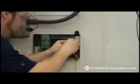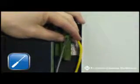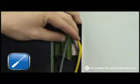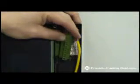Twist the shielded and black wires together. With the probe terminal block removed from the board, insert the red in the top slot and the black shielded pair into the next terminal and tighten. Pull on the wires to make certain they are seated and repeat the process for other probes.